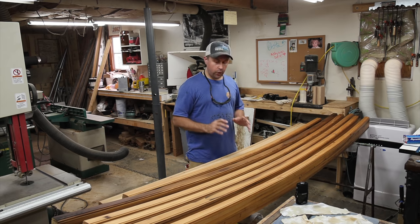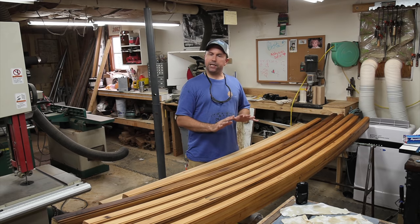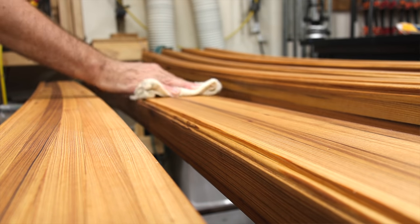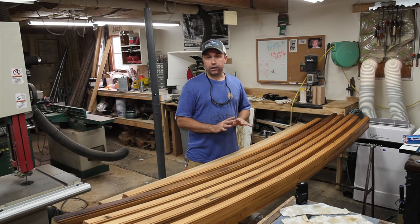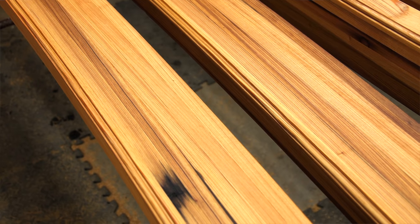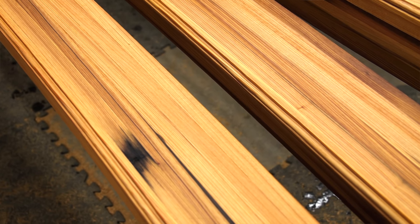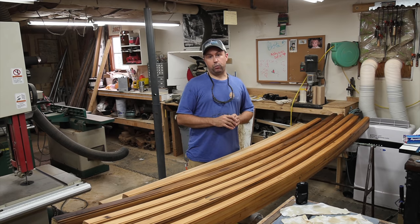And the other thing is, I wish you could feel the finish on these beams, because that wet sanding process gives them a silky smooth finish. I just love it. I do it on most of my woodworking projects, and it'll make it a lot easier to clean. When we come back and do our top coat of poly, it'll be that much smoother and easier to apply. So I'm very pleased with that process and how they came out in that respect as well.